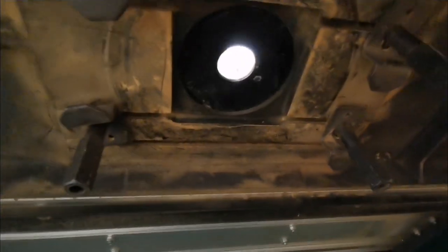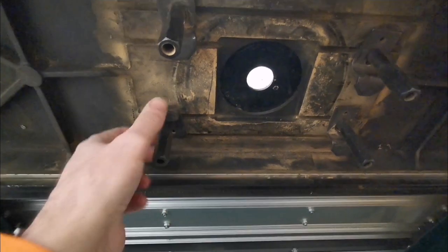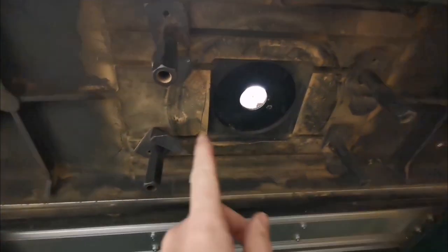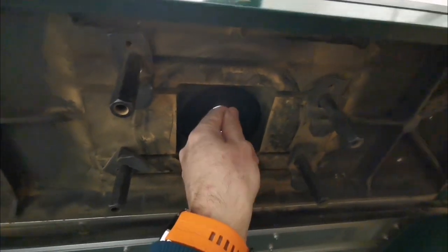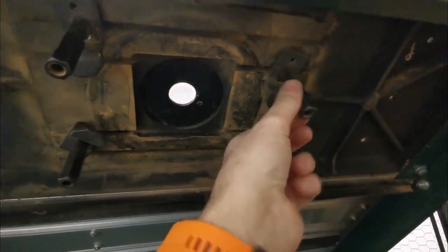Your router sits there with four very hefty brackets in a slotted cast-iron containment system. These rings are interchangeable, so they can come out for smaller cutters, and then you basically bolt it up — there's a long thread on there, which is great.